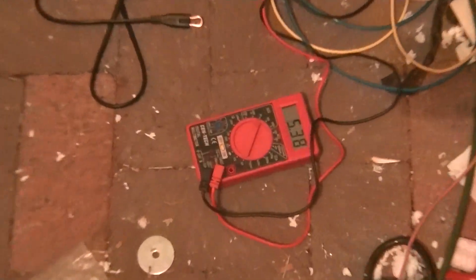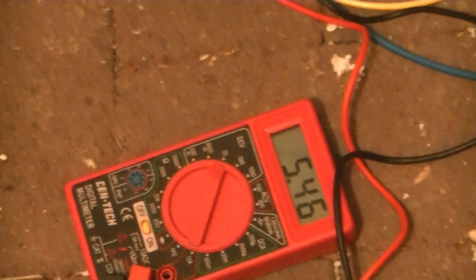You can see right there, there's a potential difference of over 5 volts across that cable, with certainly less than the 4-something amperes that would normally come from the 50-watt lamp. And it is, of course, very warm to the touch — well in excess of 100 degrees Fahrenheit. Which is not good.